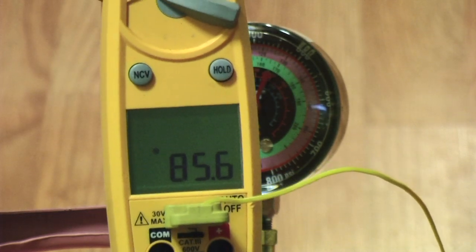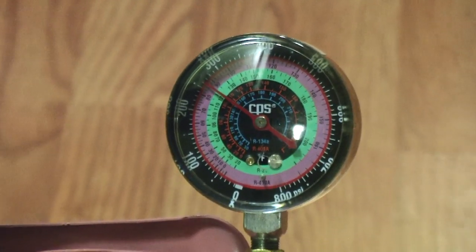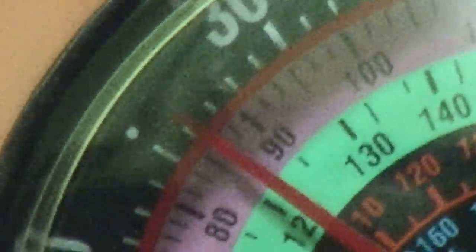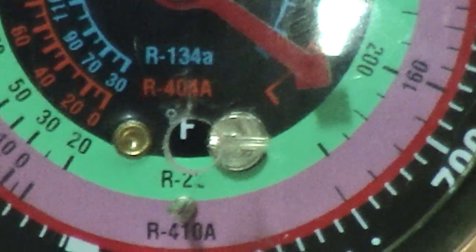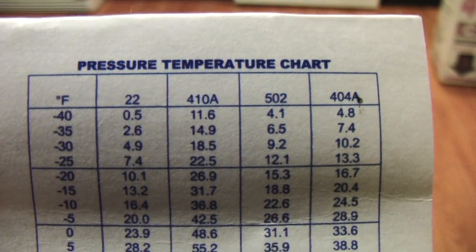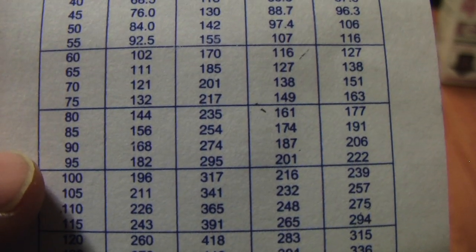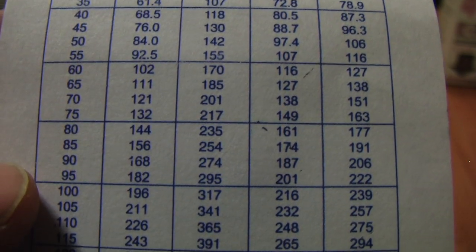Right now it's 85 degrees — that's what the tank is. I'm going to turn the tank on, and if we zoom in, it should be sitting right on 85. It's off just a little bit, so I'm going to go back to that set screw and adjust this until it's 85 degrees. If you don't have the temperature on the Puron gauge, we're going to go by the pressure temperature chart. Find the R410A column, which is the second one, go down until we find 85 degrees, and go straight over — it will be 254 pounds. So that's what we need to set our needle at: 254 pounds for R410A.